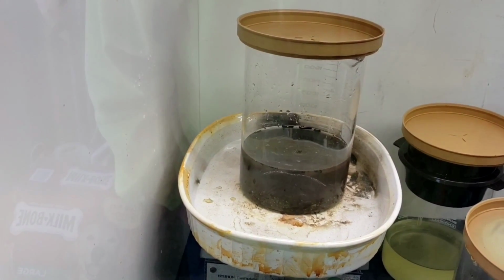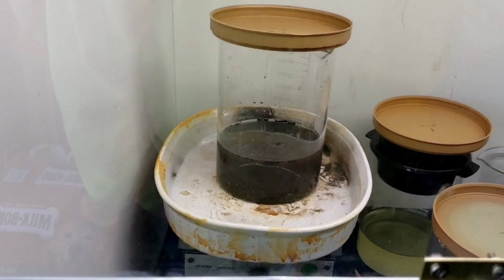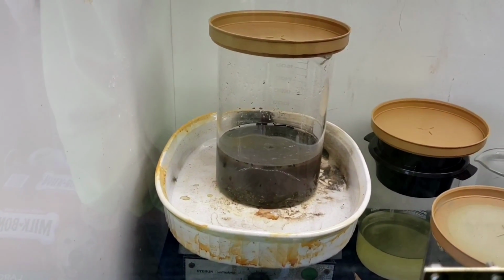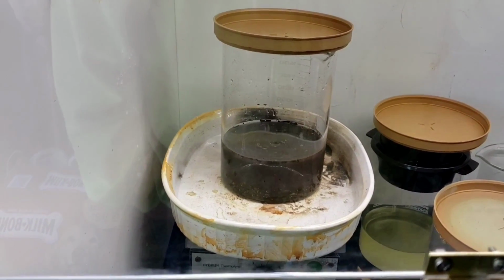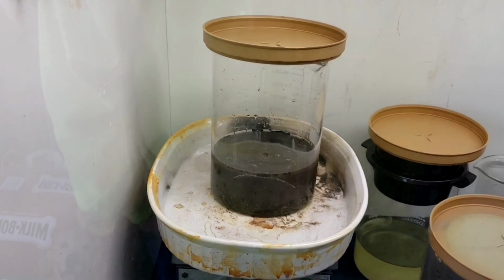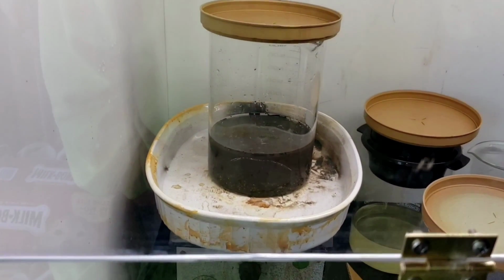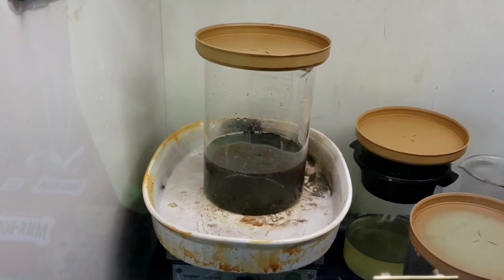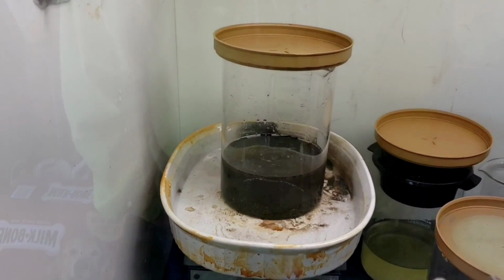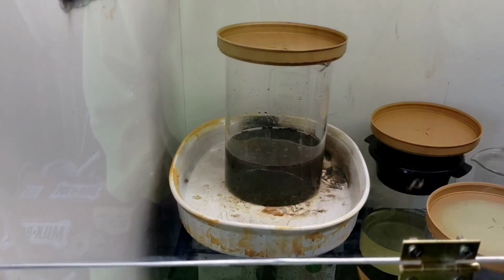If you ever run into this, you don't want to just throw full strength nitric on copper all at once. Most of that's water with about 50 milliliters of nitric. The nitric's 50%, and I'll slowly add it as we go along. As you can tell, there's no vapors yet. I'm letting it heat up now. Once it gets hot, you'll probably see the nitrogen dioxide coming out. But I'm only going to put it in there about 50 milliliters at a time, just so I don't have a boil over. Just something to keep in mind. Back with you guys in a little bit.